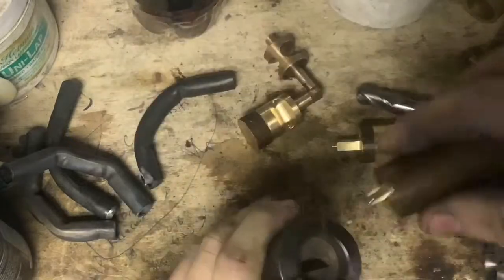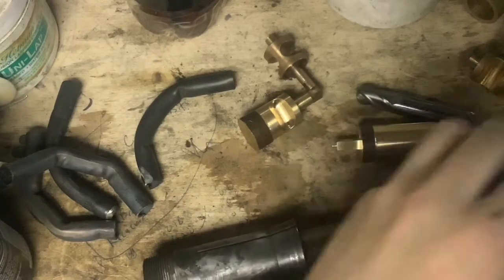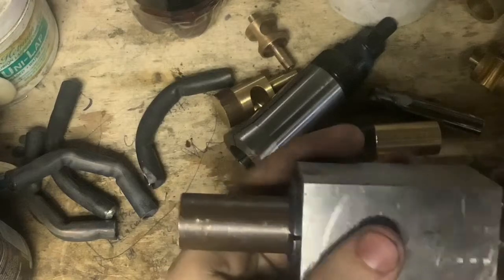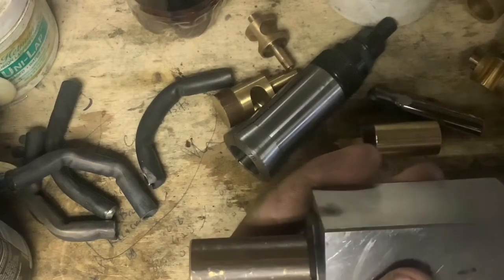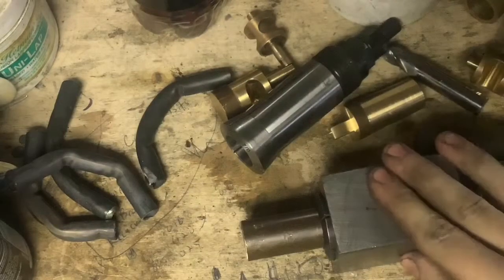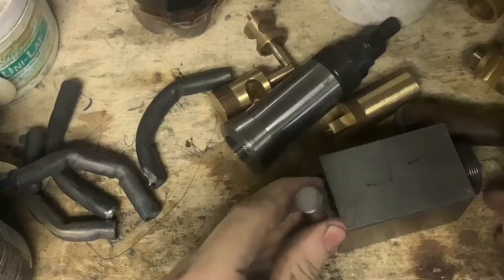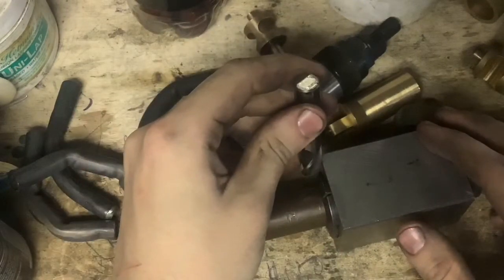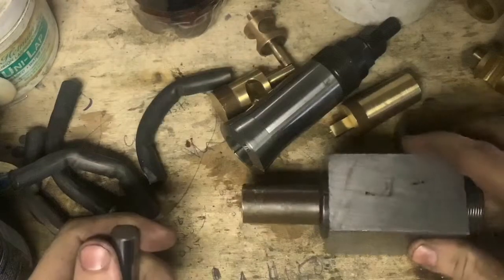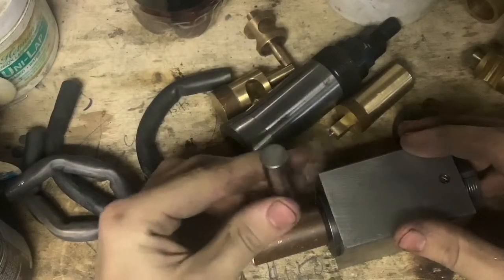Here's my blank — it fits in there. We got that in the collet block. All we do is set that up in the milling vise, 90 degrees to the vise. We come through and touch off the face of the collet block, which is a surface we can trust. We touch off that face, offset our Y to where the centerline of the ports goes through, and we plunge left and right. Then flip the collet block over — don't have to mess with the Y offsets anymore, that's a set-it-and-forget-it. Plunge left and right. That's all it takes.